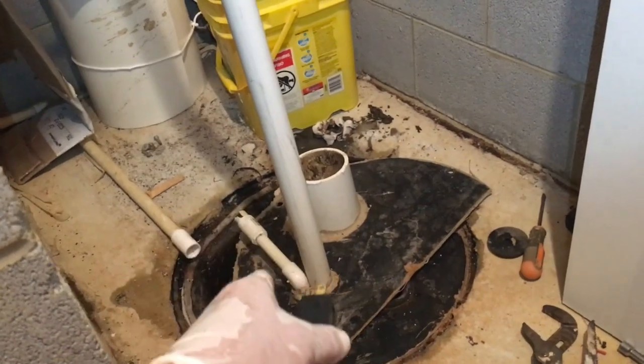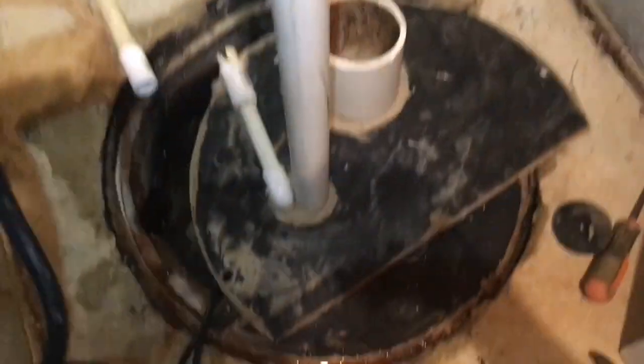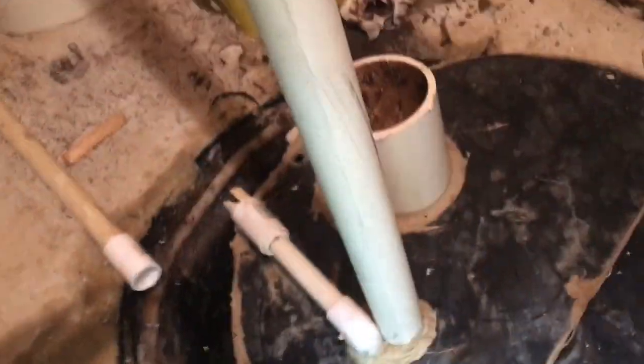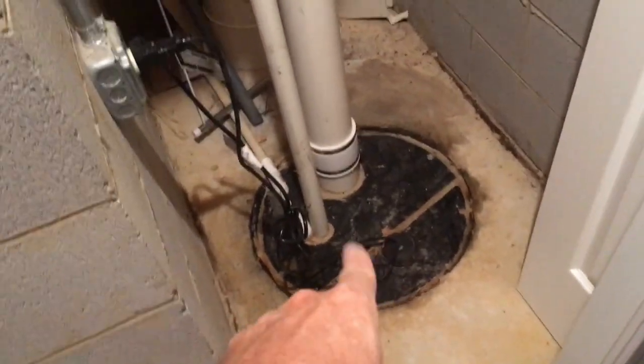What we're doing now — I've got the new pump dry-fitted and mocked up, and I've got the pipes reconnected. That's a check valve, which allows water to pass through one way but not back towards us. We're going to fire this thing up and try to evacuate all the water before we commit to gluing. It's pretty quiet but we're starting to make progress. Once we get that water cleared out, we can see better and commit to gluing everything in place. Here's a little sludge we're cleaning out — that's dirt. Humpty Dumpty is put back together again with a brand new sump pump in there.